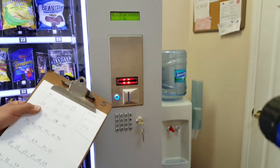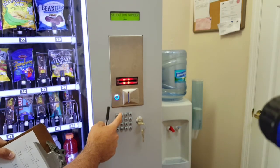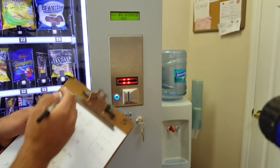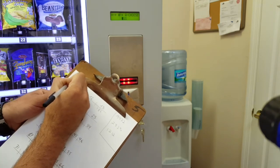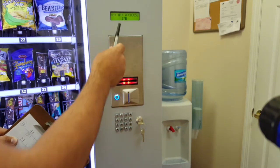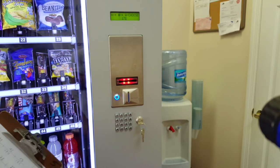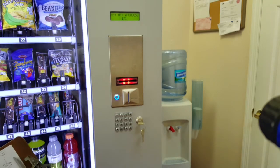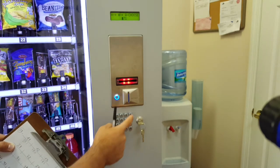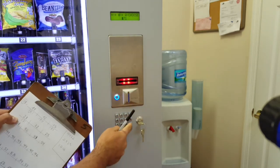Press C to go back. Now we enter selection number 21 for the next tray. Assuming we used connection 18 for the first tray, the next one below will be 17. Connection 17 comes up on the display meaning it's connected. We enter channel button number 1, the leftmost connector on this tray. It goes in, so we press A to save and record 171 on our chart. Press C to go back.